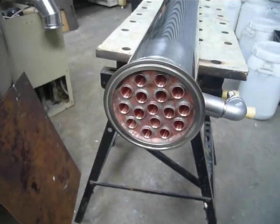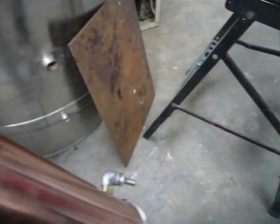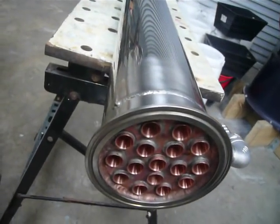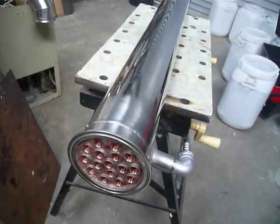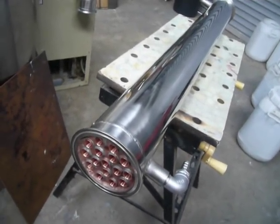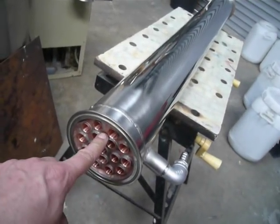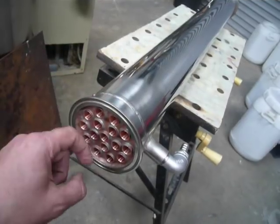There's actually a third reason I go with copper internals in a stainless jacket rather than an all-copper jacket: price. Copper is generally five times more expensive than stainless. Even scavenging around junkyards, the stainless comes in at a lot lower price per kg scrap weight than copper. The copper is way more expensive even at scrap weight.